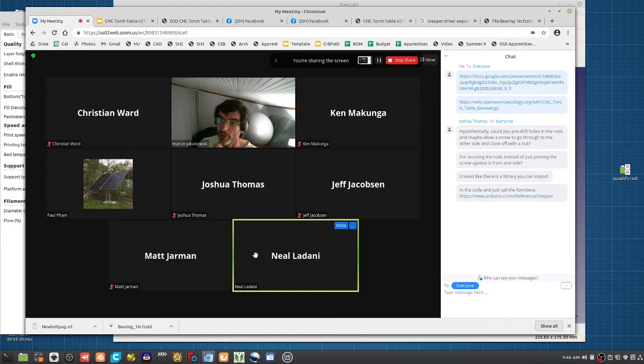So, I mean, you can do finite element analysis on this thing, and it will tell you certain things. But I think the reality is, if you do a rapid build, just print yourself one of the pieces and see how much material is necessary to make it hold still. In a rapid prototyping sense, that's what you want to find out. Because it looks good on paper here.